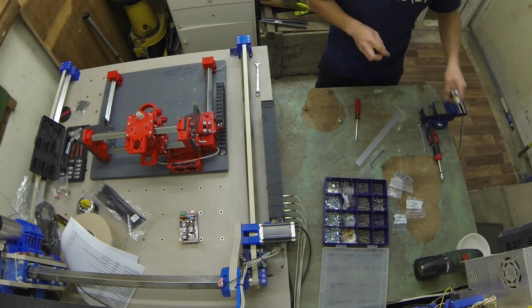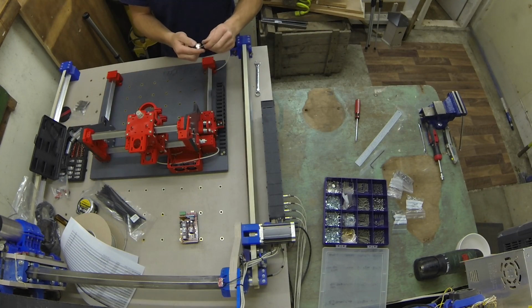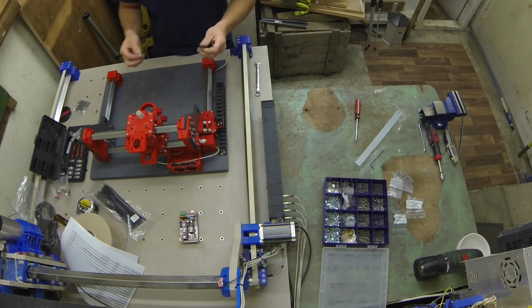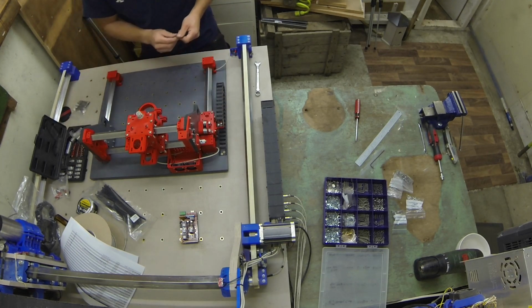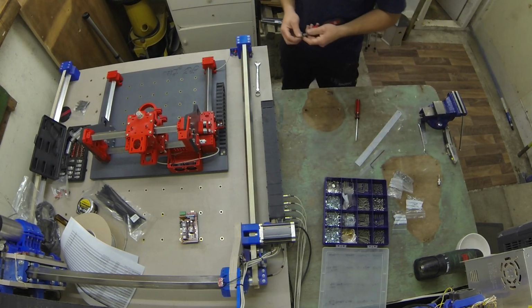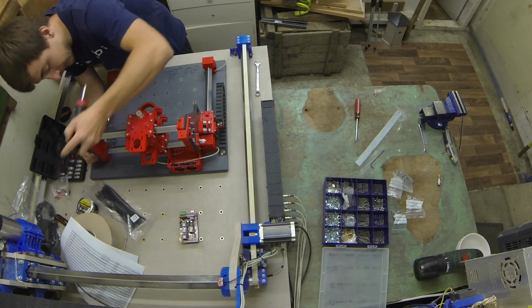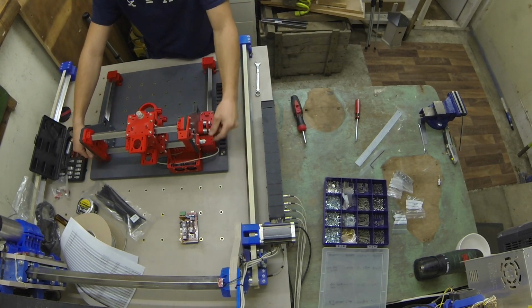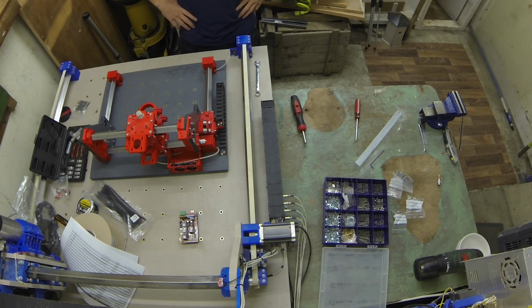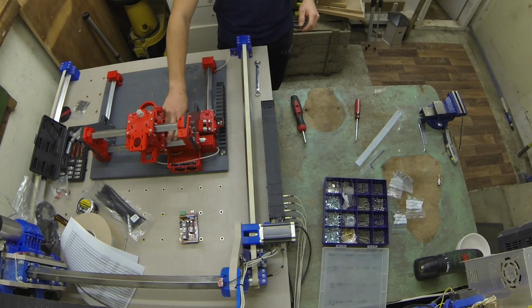Perfect. These are 8mm bore 20 or 22 teeth pulleys that will go on either side of this. Make sure they're even. So if your gantry is slightly wonky, you will loosen off these two grub screws and counter rotate the belt on the pulleys, and it will give you some fine adjustment. So that's our connecting belt installed. That runs through the centre of the bottom box section.